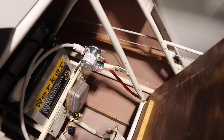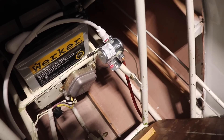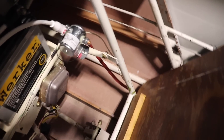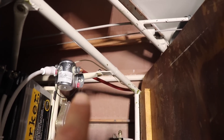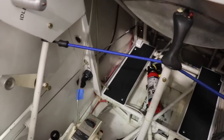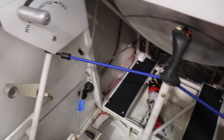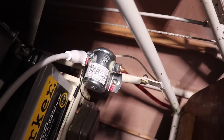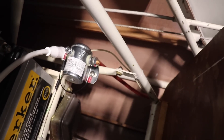Looking in the back of the airplane, you can see the brand new starter solenoid and my new battery cables. This one goes to ground on the airframe; the other is the positive. The only cable I didn't replace is the red one that goes from the starter solenoid all the way up front to the starter — I can't get in there to cut the zip ties and route a new cable without taking the side panels off. Luckily, because the lugs are bigger on the solenoid and starter, that cable actually has the proper terminals on it, so there's no need to replace it.